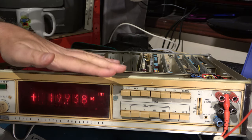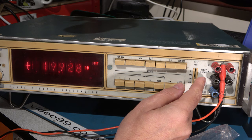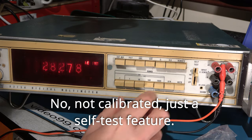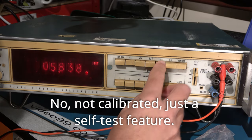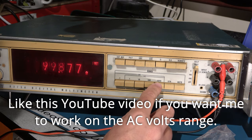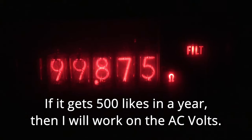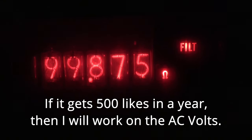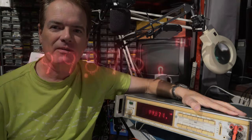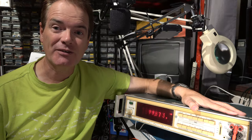I'll put the cabinet lid back on because it makes the display a little bit easier to read. So: the calibrated 20 volts DC, the completely uncalibrated 13 volts AC, and the calibrated 100 ohms which works well, including in kilo ohms range. Let's just enjoy the beauty of this display with the lights turned down. We've gone from a completely non-working state to a mostly working condition on this beautiful Fluke 8375A digital multimeter from around about 1972 — about the same age as my Hillman Avenger car. It's a fantastic piece of technology for its day. Hope you've enjoyed it. Bye for now.